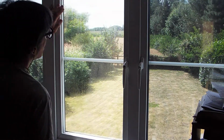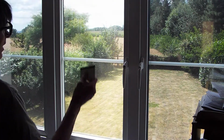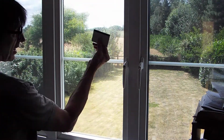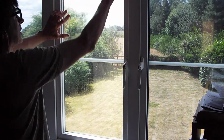Okay, that's the majority of the water removed from behind the film. But there's still some there. So to lock it down properly, my film is now thoroughly wet from using that one. I get the hard edge one here, start in the middle and push to the outside to lock it in.